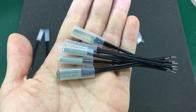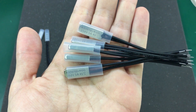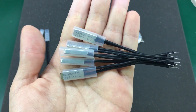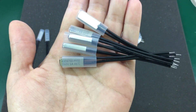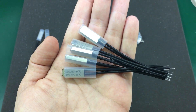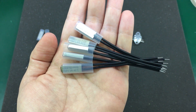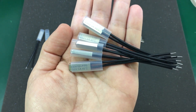Next, I have this set of five, which are also metallic, but these are rated for 45 degrees Celsius and are normally open, which makes them ideal for turning on a cooling fan once the temperature of a device reaches a threshold. 45 degrees Celsius seemed like a good choice, because I imagine I will be losing another 5 degrees on the thermal resistance between this switch and the heatsink, then between the heatsink and the package of a transistor I might be losing another 5 degrees, and if I'm also losing 5 degrees from the case of the transistor to the junction temperature, this brings us to a junction temperature of 60 degrees when the fan will turn on — and that could get worse in practice depending on how everything is connected on the heatsink.